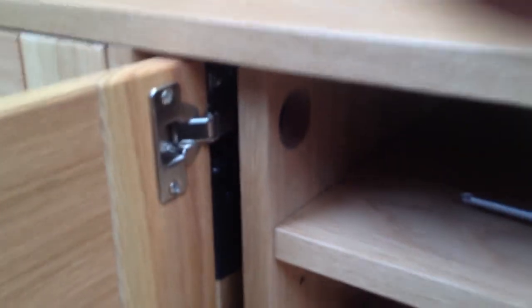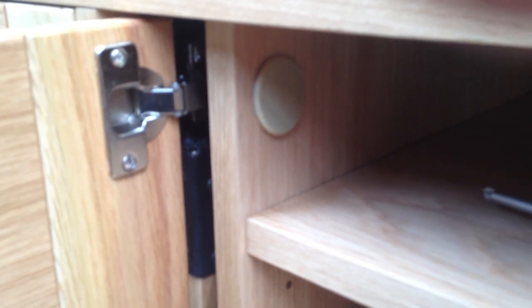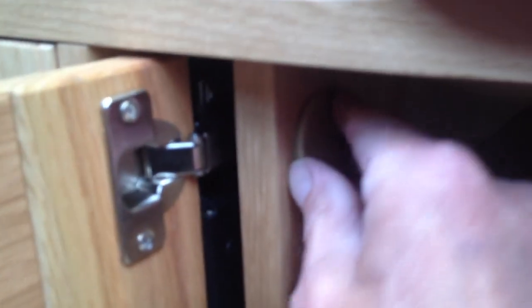You'll notice these side panels have a hole — a 35mm hole which gives access to the screws for adjustment, so that can be adjusted on site when we get there if the floor is not level. To make that look nicer we put these cover caps in; they press all the way home. They're a bit tricky to get out again, so we don't fit these until we're absolutely certain it's in the right position. They come in different colours for different coloured cabinets.